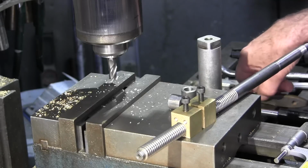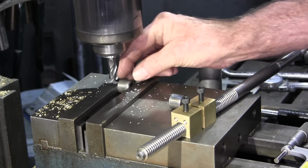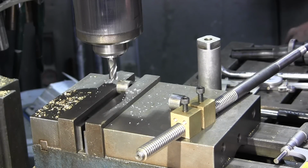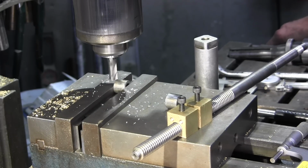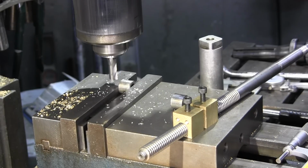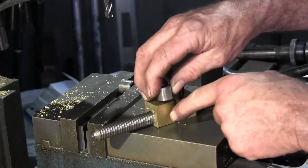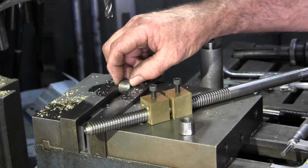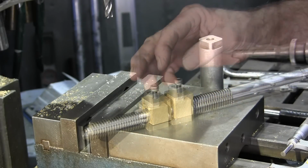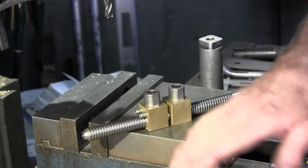Okay, now let's go ahead and put the next one in here. There we go. All right, two flats, and they both come in on this side here. I'm going to go ahead and lap those surfaces, making sure that nothing's sticking out past them. All right, we lightly tighten our two slugs here that hold them. The flats are mounted on this side in relationship to the carriage.